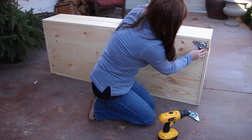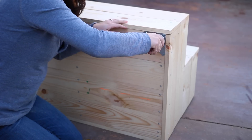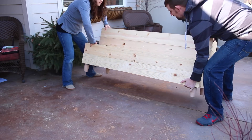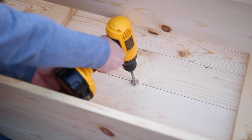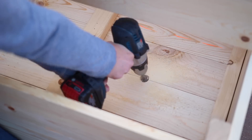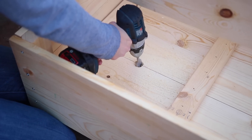Now flip it over to attach the top plates and the feet. Top plates are super easy — they come with screws, so just screw them into place and attach the feet. When they're all in place, get a helper to flip the whole box over. Using the one-and-a-half-inch spade bit, drill three drainage holes right down the center of the box. You can add more if you want, but three worked out just great on a similar bed I built before.